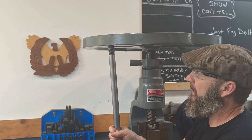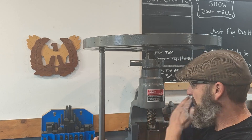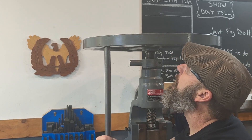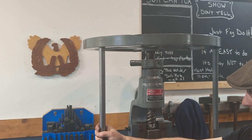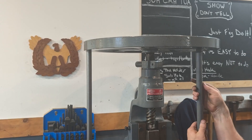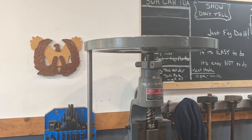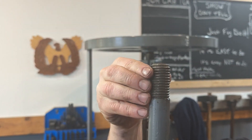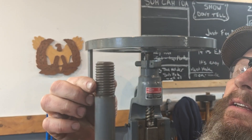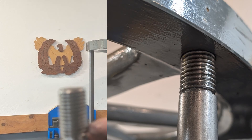Let's try this one. Once these go in, they're not coming out. So I've got one made — this is the third. Much better. All the way in, flush on top. Let's compare these threads. Can you see these threads? They're to a knife's edge — the crest and valley — it's very worked in there. Compared to this one where it still has a robust thread.